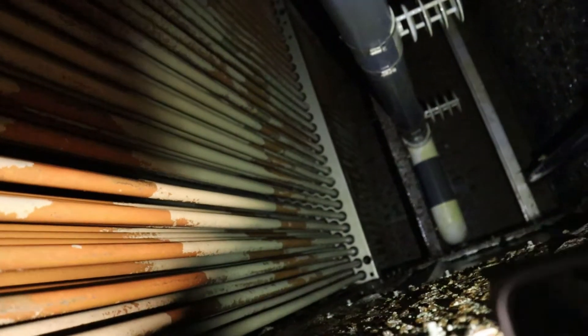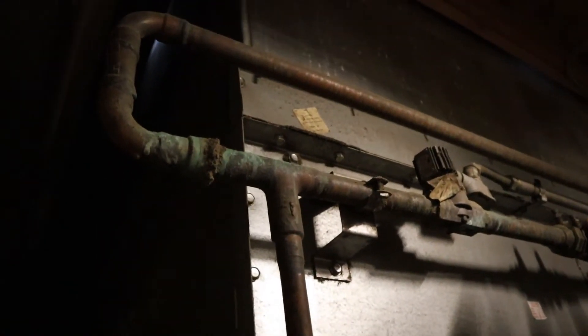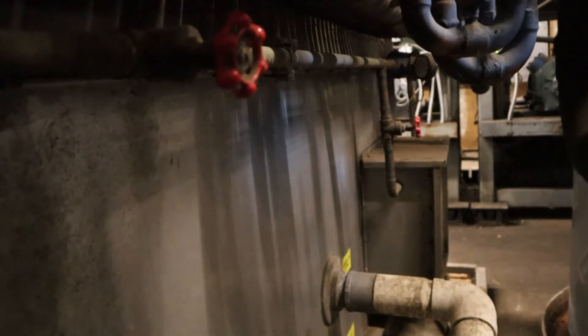Going inside to show you a little bit of light so you can see it — water coming in all throughout all those spray nozzles, just spraying on top. I'll turn it on in a little bit so you can check it out. The water supply coming in from the store — that's the main water, the emergency water line. If that pump goes bad, that's going to be a savior right there. Water going down so they can wash the condenser, then going into the floor right there for the water supply into the tower.